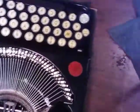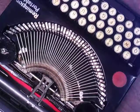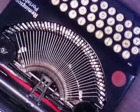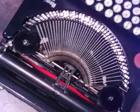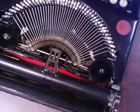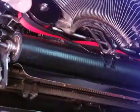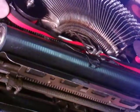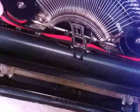There's something else I wanted to show you about this. I had to replace the draw band. This is that 1921 machine. It's interesting how the ribbon goes around all these different ribbon spools differently — 1921, '23, all those years. See the ribbon spool? It's got this little bar behind here. You have to go over the bar but behind the little tang there, between the two — whereas on the newer ones you're just going over the ribbon holder. So here you have to go behind that little bar. That was one of those little things.